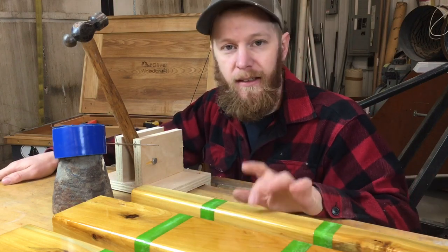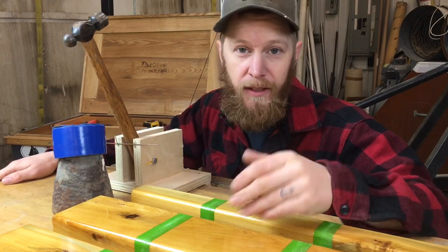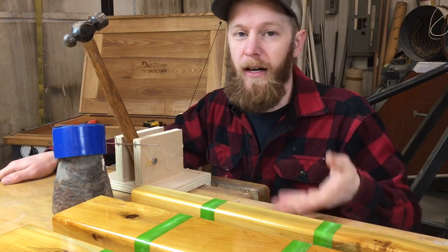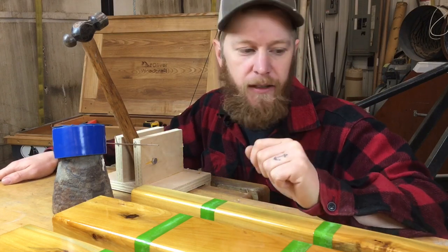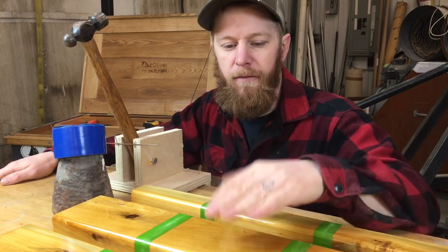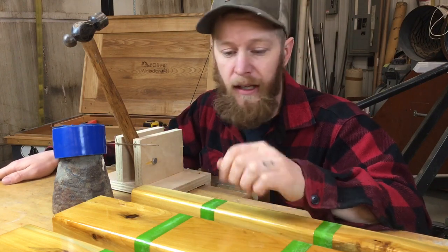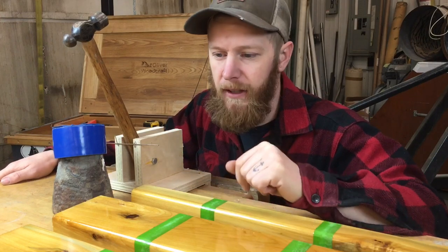One of these pieces, this little guy here, is actually going to go outside and it's going to stay there for a year. So there will be a follow-up video to this where we get to see the results of that. The bottom will be sealed in epoxy, so there's no water coming up from underneath. It'll just have to be the actual varnish that fails or doesn't fail. Another piece is going to get turned face down in a bucket of water, and we're going to leave that there for another extended period of time. And I'll probably cover the results of that in the same video.